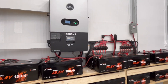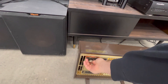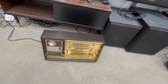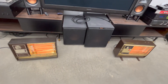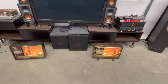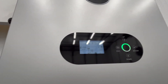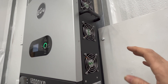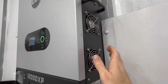So what can this run? First, let's turn on a couple of heaters. I'll put these on 1500 watts — they are on their own circuit. So they're nice and glowing. We've got 1500 watts — should be around 3000 total, but it's actually reading 4700. And with that load at 4700 watts, the fans just turned on. It's kind of quiet, not really that loud. All of them are on, blowing warmish air — not hot, not that loud.